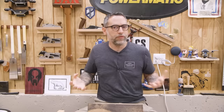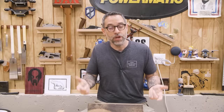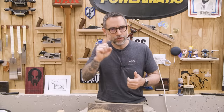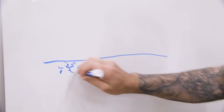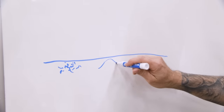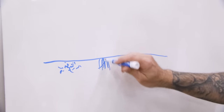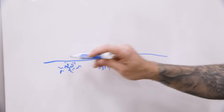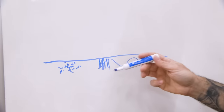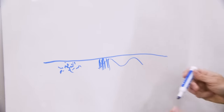Woodworkers have all kinds of different tricks for preventing blotch, but they all kind of operate on the same principle — let me show you with a drawing. Let's say this is the surface of our board. We may have an area here that's really soft so it's going to absorb more color. Then we have an area over here where the grain changes directions a few times, so maybe on this spot here it's thirstier. Think of it as straws pointed upward, so it's going to absorb more finish there. That's what causes that uneven absorption.